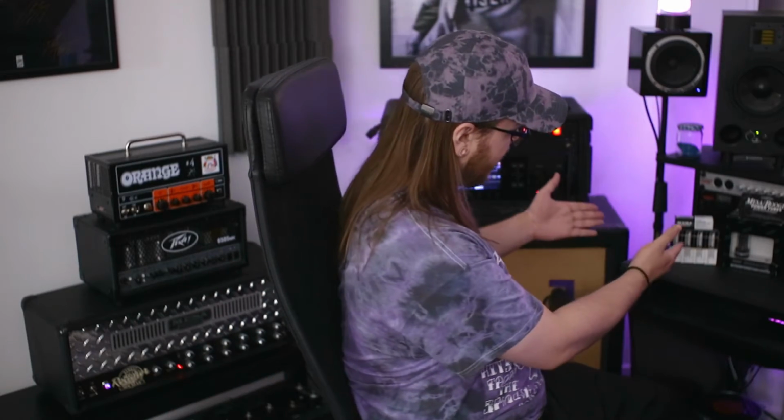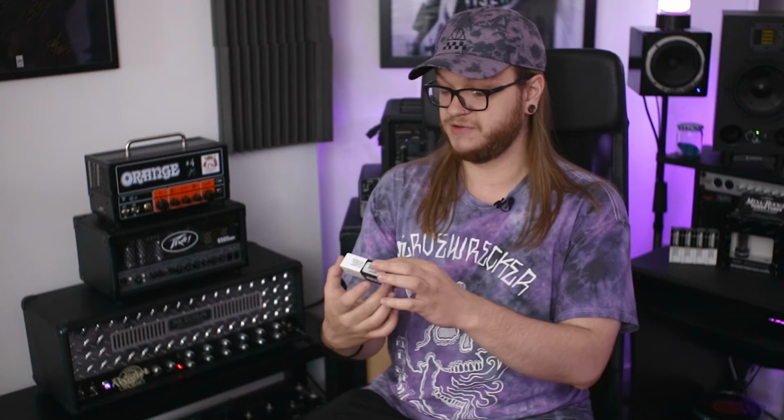I'm also going to be changing all the preamp tubes, which currently are also JJ's. As you can see here, I have a set of 4 Mesa 12AX7's, and I also have one of their SPAX7's, which are their sort of premium grade 12AX7's. They recommend that you put one of these in the V1 position, and it was only a little bit more money, so I just thought, why not?